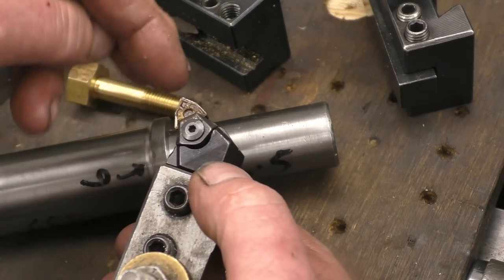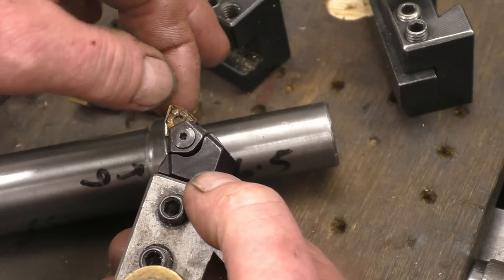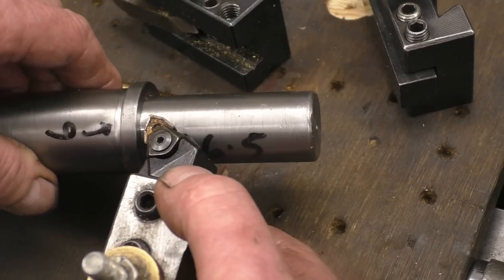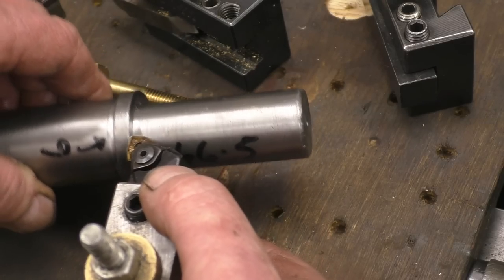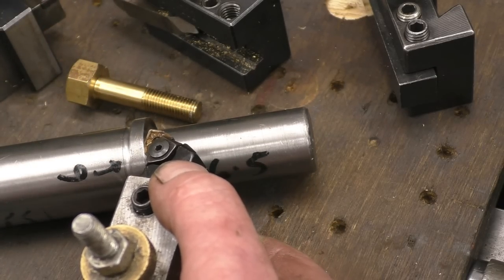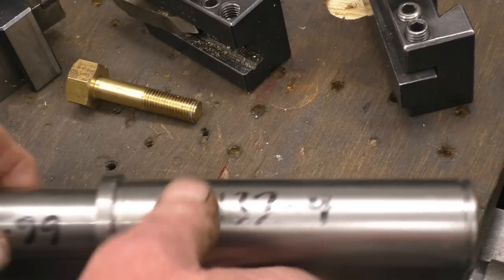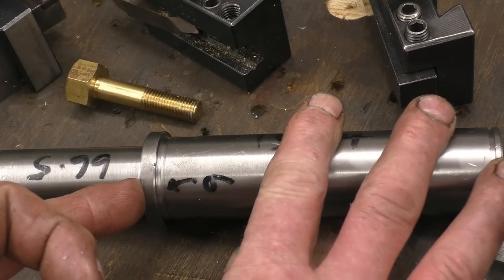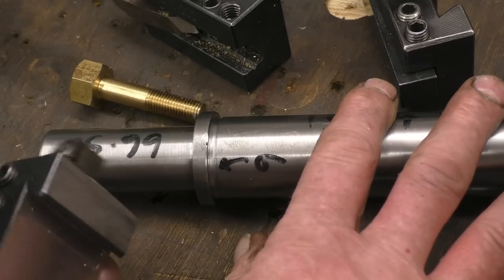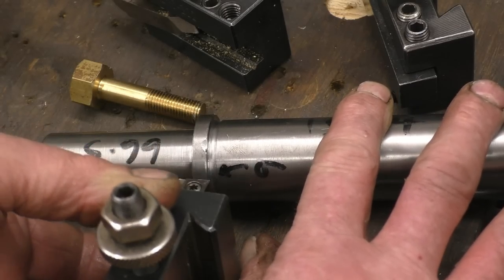That's another right-hand knife tool. As you can see, that's also less than 90 degrees, and it's got a more pronounced round tip — that gives a better surface finish but will leave a bigger radius in there. There is a way of getting around that which we'll show as we carry on. If you wanted to machine to a face on there, you would use a left-hand knife tool, which will machine in there and then come out.